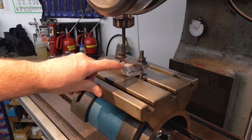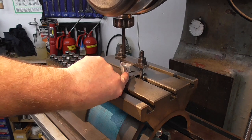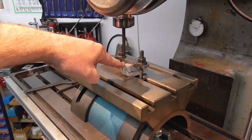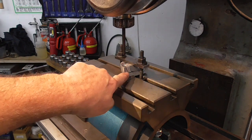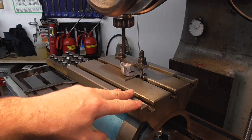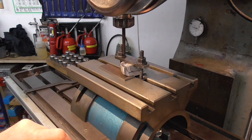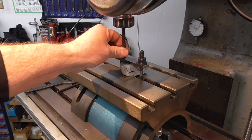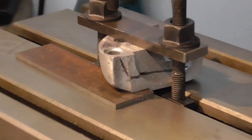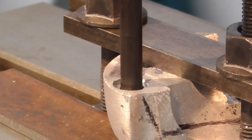We're ready to drill the feed hole through, which is going to be in two stages. I'm going to go down at that angle, probably following these black lines from this hole here and then come from the other way to meet that drill way. I've got it set up on the angle plate with a strap across and a packer onto the flat portion on the other side. I've just got a transfer punch in there at the moment and all that does — if I zoom you in a little bit — is allow me to locate that hole there.